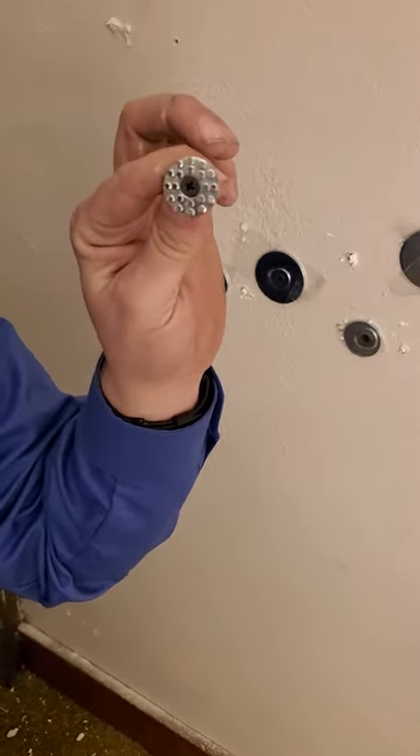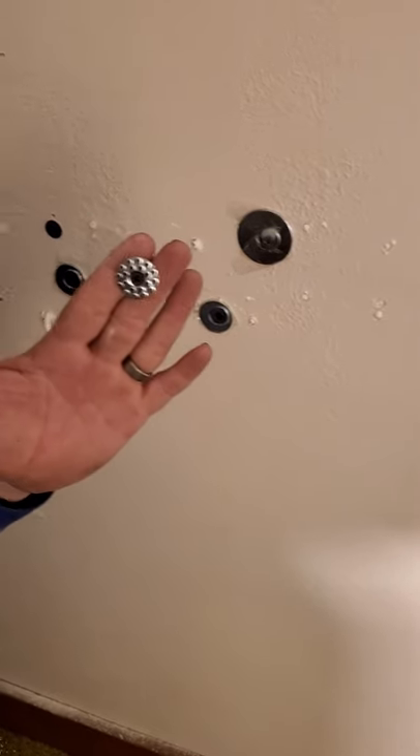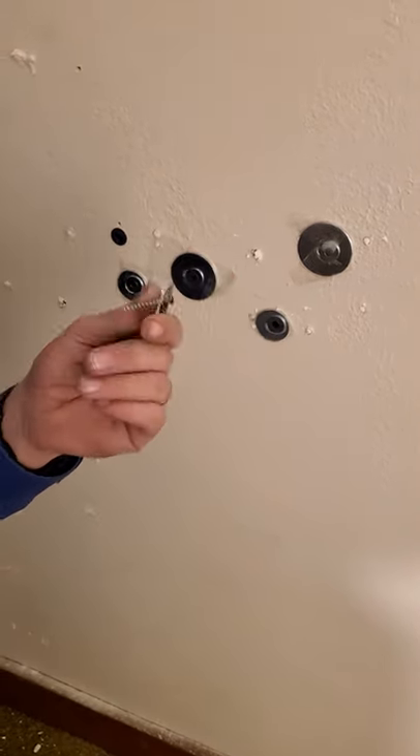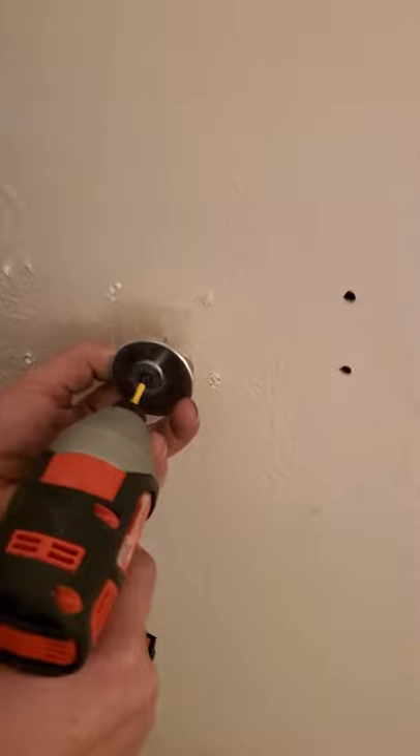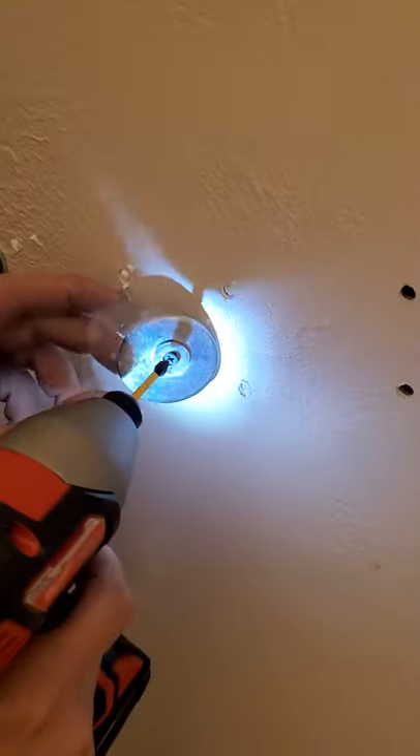We let it set and I ran out of screws completely. I discussed about having these plaster buttons that I hate — well, I ran out of washers too. So there's going to come a time and place where I use these to help hold things together temporarily. I'm just not going to permanently use them because, frankly, they're garbage. So after I'm done they're going to get thrown away and nobody's ever going to think of them again. But I'm going to continue to work my way along and once again miss the lath. That would be why there is a crack right here — it's running along where the lath is missing.